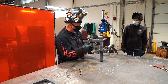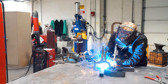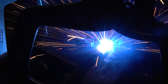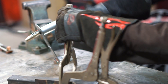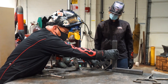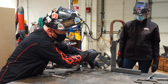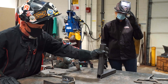Nice and tight — you've got to have that. The closer the better. Now we're going to run complete across from one side to the other. Pull that up nice and snug — perfect. All right, here we go. Unclamp it, go ahead and unclamp. Same way with that. You can use this to help stand that up — you can clamp this on the end of the table to keep it secure. We've already got a good strong weld on that side and that side, so the odds of it wanting to walk over are very slim. I just want to demonstrate that you can use this square now that we've built it — you can do 45s with it, you can do 90s. Handy. We're going to run a fillet.